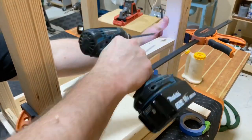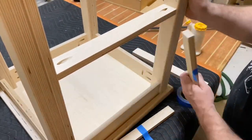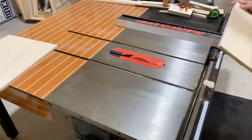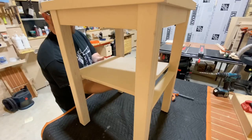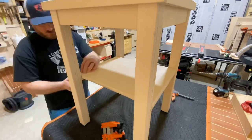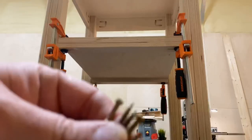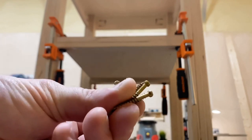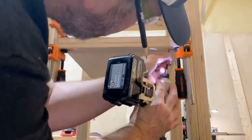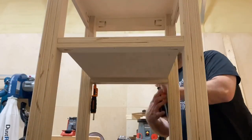You could call this table done — the legs are strong enough — but let's add a little more strength and functionality. We're going to add a shelf. I've got two spacers attached with blue tape at even levels, and a piece the same length as the aprons attached perpendicular, about 12 inches down. Then I'm going to cut a piece of Baltic Birch and just slide it in and attach it with some flush trim screws — they go in really nicely and the heads don't protrude.